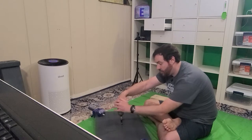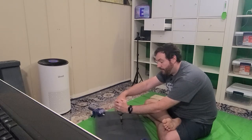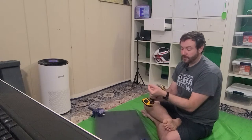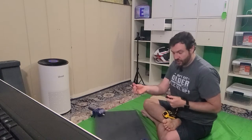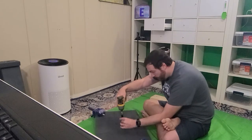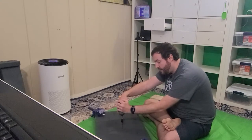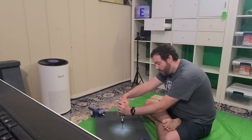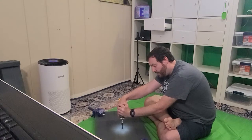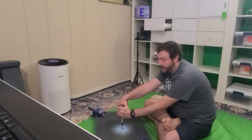I'm going to give it a test, as close to center as possible. The trigger here goes backwards and forwards - you want it in the forward position. This is a Phillips bit. I want to stay as vertical as possible, start off slow, then push pressure down. That was the impact wrench hammer itself - that is the noise it makes when it has reached a certain resistance.